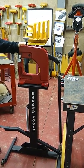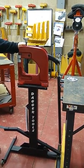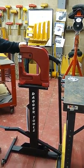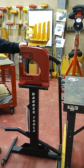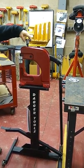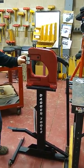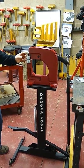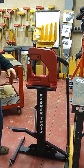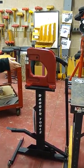We have a one-piece lever design for our foot-activated machine, which allows us to produce in excess of 6500 to 6800 pounds of force under any given environment. Operationally, we have a short stroke adjustment and we use the Lancaster-style jaws in our machine — because they're small, they allow greater access.